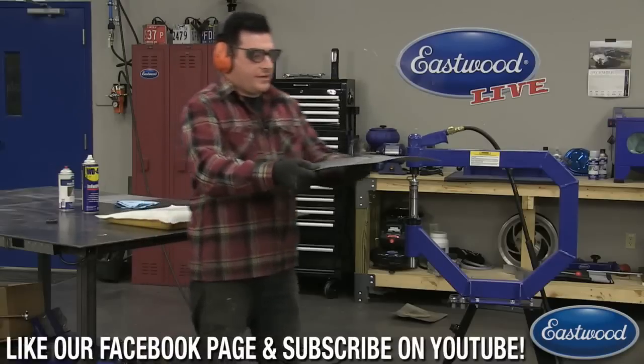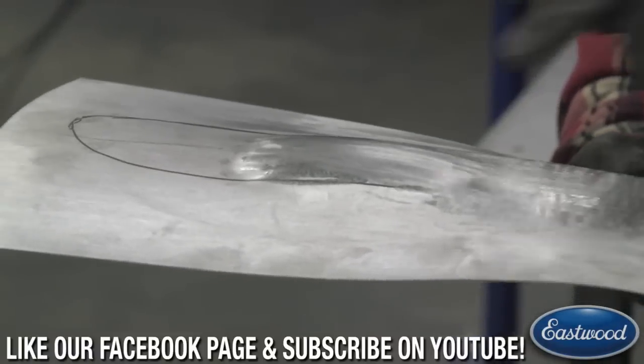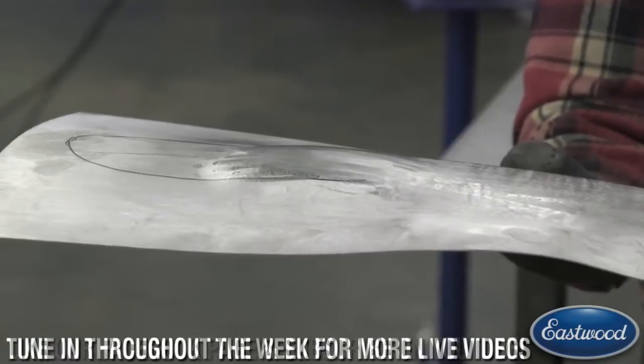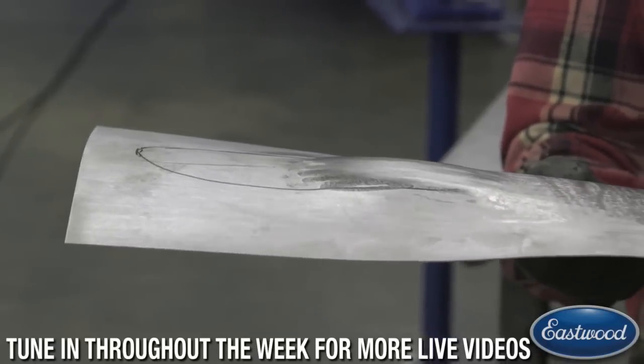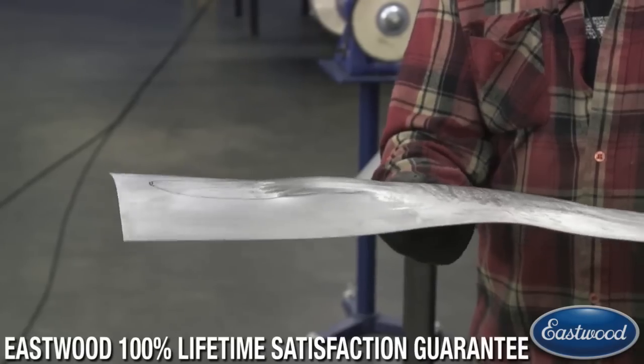So real quick, Joe could probably get a shot sideways. You can see I've already raised this higher than what we do with the hammer and planishing with just that little bit. So you've got to be careful. This hammer has a lot of power. If you crank it all the way up and you have a good air compressor, you could overstretch it.